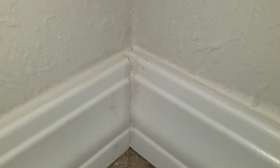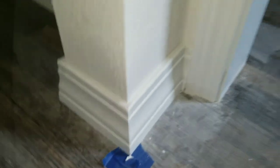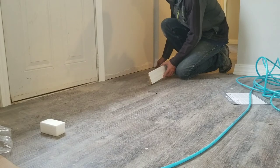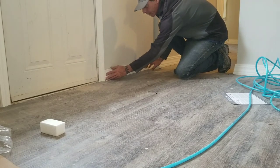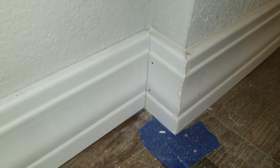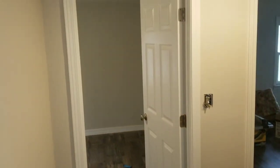They still need to be painted — that's just the caulking — but everything comes out clean. Here's a really bad one in the closet where the caulk shrunk up, but compared to 45 bevels on each end, this just comes out consistently cleaner every time. I just measured straight across the floor; if you have a door, put your tape in and measure that way. Bam, done deal — hope you guys learned something here!